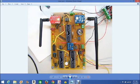This circuit here is a real-time clock circuit that has backup power from a supercapacitor. There's this crystal. All 3 of these processors have 5 megahertz crystals. They use a phase lock loop to turn that into effectively an 80 megahertz clock frequency for each of these three. And these are parallel processors. Each has 8 cogs and can perform 8 processes in parallel, not multitasking. I guess I call that multiprocessing, right?